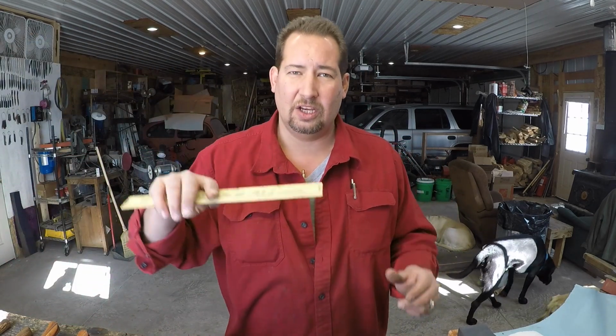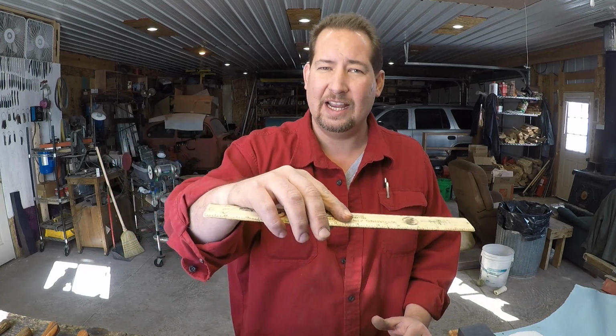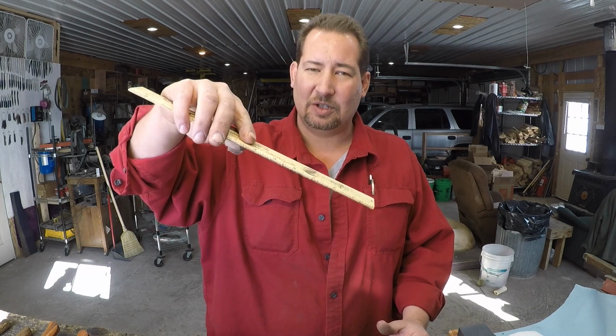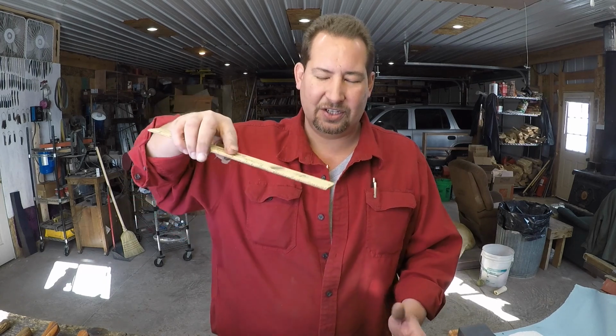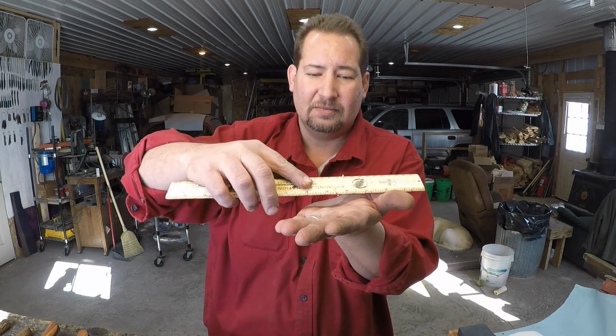Coming across more comparisons to everyday life. Like my comparison between a knife edge and a pencil point, the one I came up with last time, which was totally on the fly, and I can't believe I hadn't thought of that earlier. But correlating, using a spatula to tell you about the right angle to sharpen at. If you take your spatula and go to scoop a fried egg up out of a pan, that angle is going to be too shallow to sharpen most of the time. Whereas if you take that same spatula and raise it up to scrape bits of burnt stuff off the bottom of the pan, that's typically too high of an angle to sharpen. So you would want to be somewhere in between those two, and then instead of scraping like this with a spatula, you're turning the whole thing and sharpening a knife with it. But that's roughly the same angle. And in my head, that sounds really perfect.